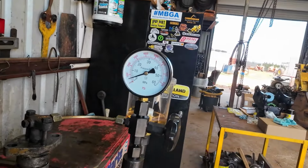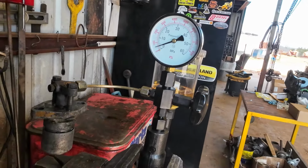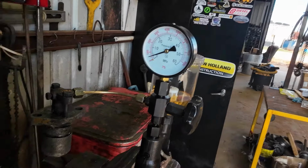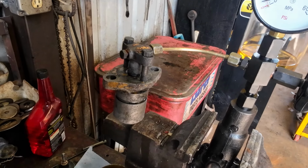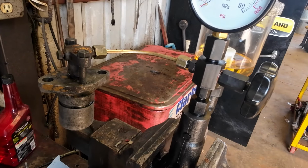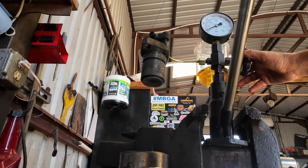But apparently I didn't do a very good job lapping that. See, I don't know that you can actually do that, because those little pieces of injector nozzle are super hard, and it'd probably take a little work to get them working right. So at least I know I can make it seal at the top, or the insides are sealing. And I may take this nozzle back out one more time. What I did is I just took the spring off, chucked it up in a drill, and just held it by hand. And a little bit of lapping compound for valves, which is probably not the right stuff to use, but I thought maybe it would clean up enough, it'd work. But let me pop it off a few more times here. I'm gonna turn this off.